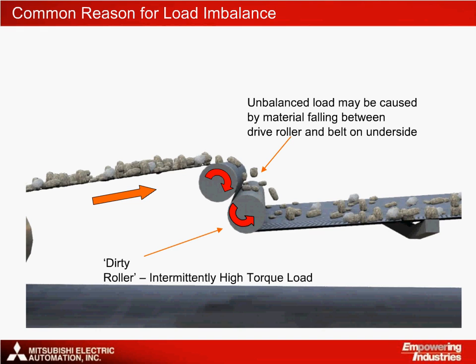That's fine in theory, but in reality there are many practical reasons why the load might not be even. In this example, a conveyor belt is transporting rocks and muddy debris. The conveyor is driven by a series of motor powered drive rollers as shown in the picture. Some of the debris sticks to the belt as it passes through each pair of rollers, causing the load to fluctuate constantly. If we don't do anything, the motor shaft speed will drop and the conveyor will be stretched on one side and start to bunch up on the other side. As well as putting mechanical stresses on the whole system, this will cause the drive current to fluctuate, which may give us nuisance over current tripping. If another motor is constantly being pulled along, there is a risk that the motor will regenerate into the drive and give us over voltage tripping.